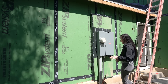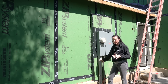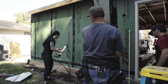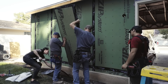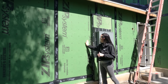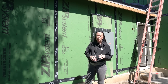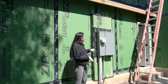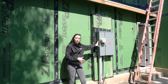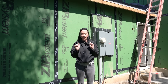The previous service riser was broken and in terrible shape. It was mounted to the brick exterior, which was flush with the foundation — but now with thin-cut stone, our walls are set back. So we framed a whole new wall, keeping it the same height as the adjacent door for a clean horizontal line. We zip taped this new wall and used zip liquid flash all along the bottom, sealing it up before setting it down on the foundation. The electrical contractor then used Zip stretch tape placed over the green panel before applying the new service, so as they drilled screws through to mount it, everything is sealed nice and tight.